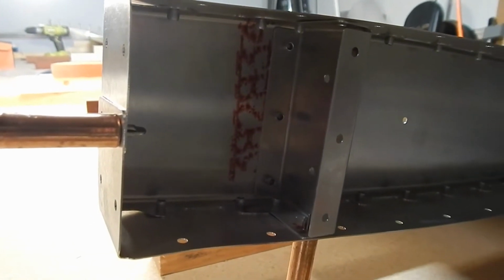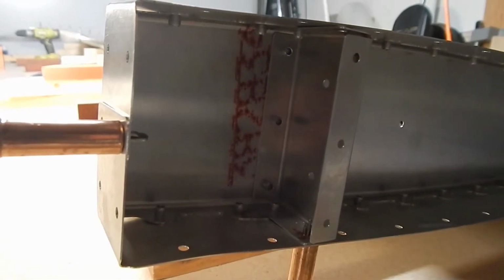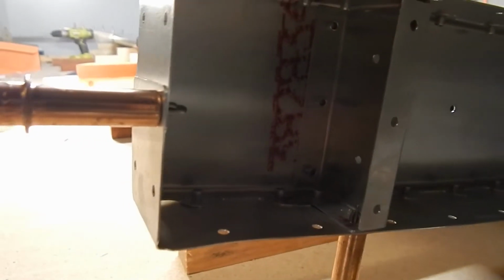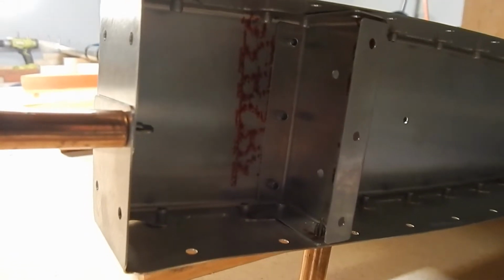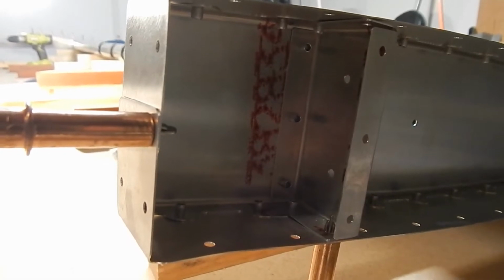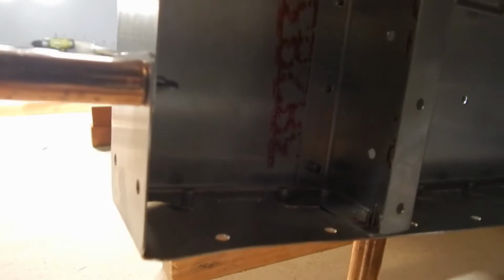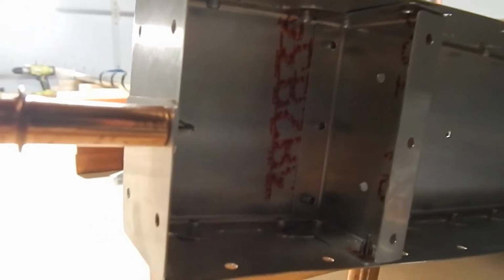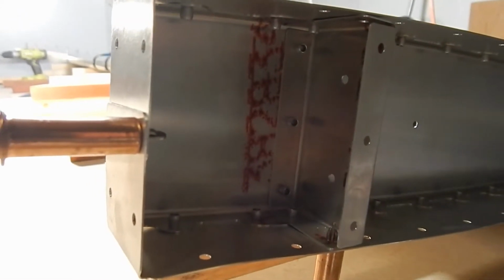Then they say you can use a foam filler after the epoxy and the BB lead sets to fill up the balance. I don't see the necessity to bondo the inside of this. Everything is so tight that I can't see epoxy leaking through anything. It's not spelled out in the manual, but several of the builders have commented. Some have done it, some have not. And a close inspection of these skins, they're very tight to the ribs and to this balance rib. I don't see any epoxy leaking through that as an issue. And again, the manual doesn't specifically say to do that.